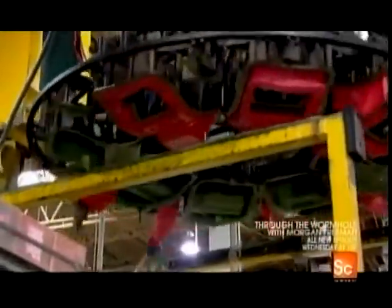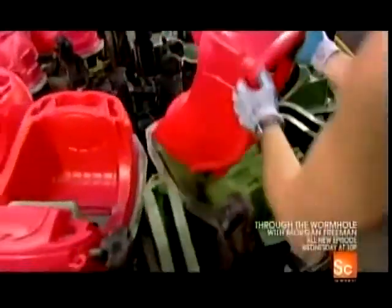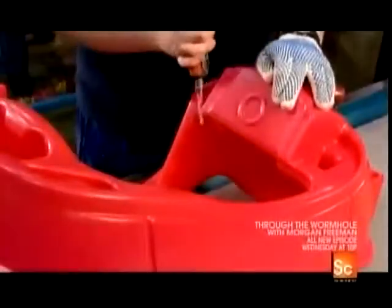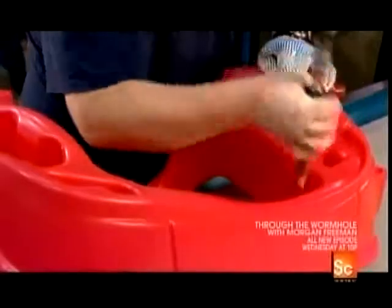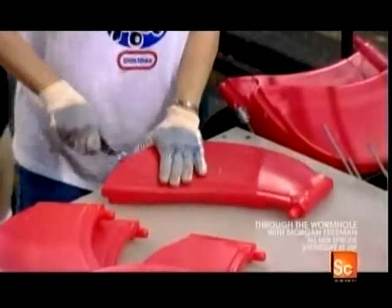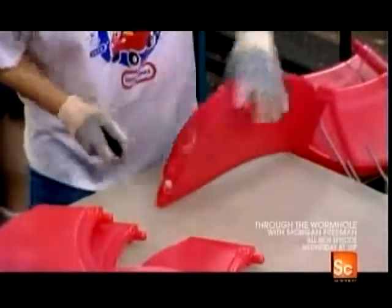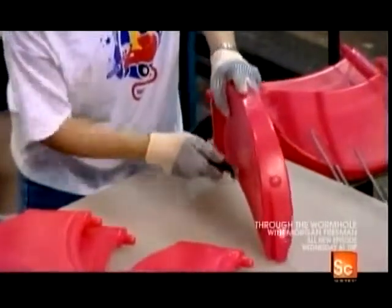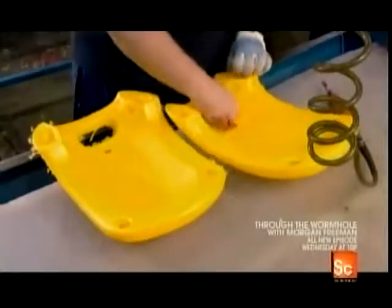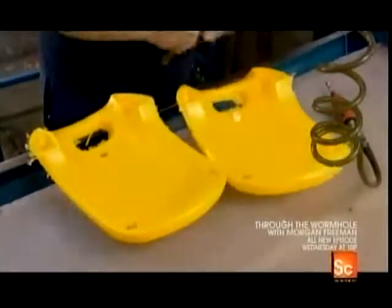Some parts fall out, and others have to be pulled out, but it's easy work thanks to the mold's non-stick surface. Seepage during molding creates unwanted bits and nubs on the main car body that they trim off by hand. They also shave areas that appear uneven. Vents were formed in the molding process to release air in the core of the part. They now cap the vents to keep little fingers from getting stuck inside.